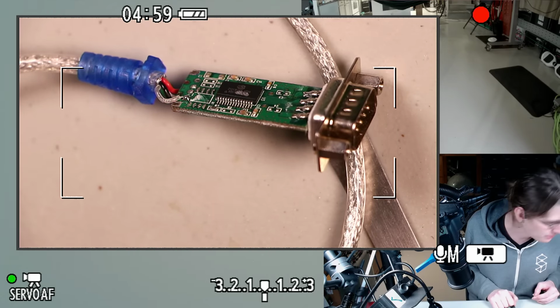So these wires look so little. Let's maybe use something slightly less skinny. Let's color code it even. Alright, so I just snapped off this little thing. I had some bulk rainbow ribbon cable female headers like this, and I snapped off red, black, and brown, so we can use red and black for +5 and brown for data.